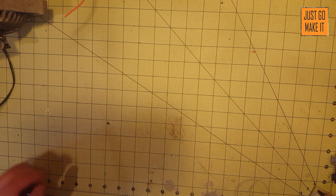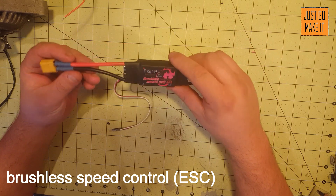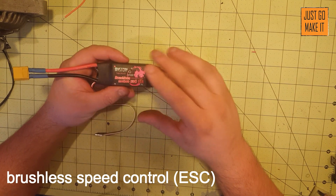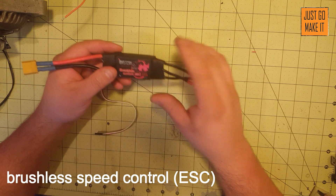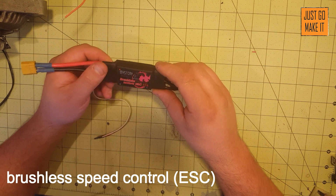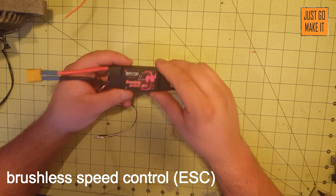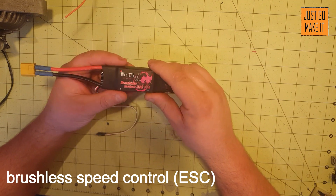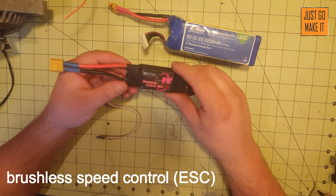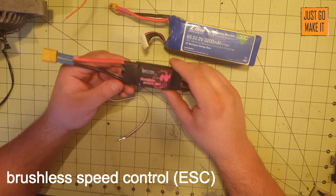You're going to need a brushless motor speed control, or ESC — electronic speed control. This one is 80 amps. I personally would use nothing under this; I'd really like to have one over 100 amps if putting this motor on something like an electric bike. 100 amps or better. You'll also want one rated at 6s, which is the number of cells in a lithium battery. So you want one rated at least 6s and no less than 80 amps.